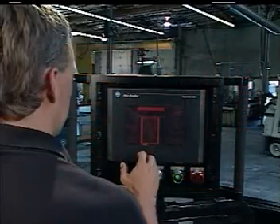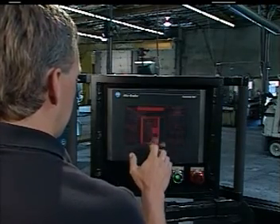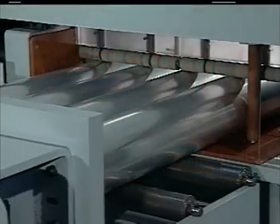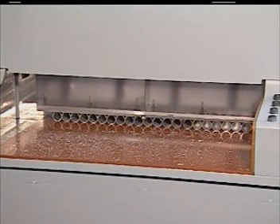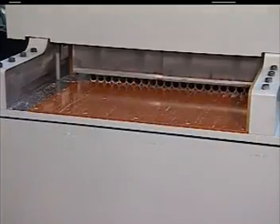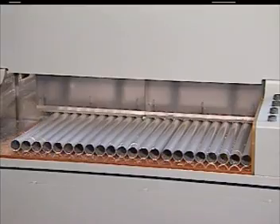For this demonstration, we will take a half-inch trim cut, two two-inch cuts, and two two-foot cuts. Autocycle will work through the specified cut lengths until it completes the cuts or runs out of material. At the same time, it keeps count of the cut parts. The pusher can index the material within two-and-a-half inches of the cut line. If the starting lengths are sized properly, scrap is minimized to approximately three inches per load, including the trim cut and end drop. And the quality and precision of the cut parts give you a finished part directly from the saw.